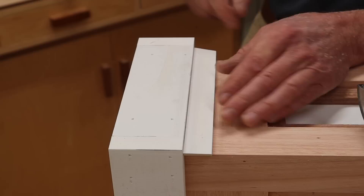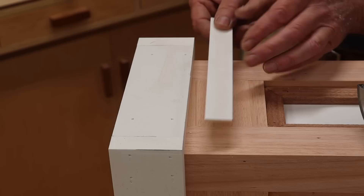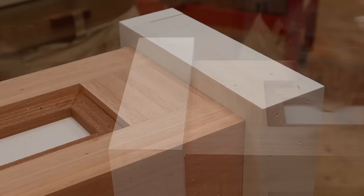The next piece of molding uses the same 7-degree angle, but I did cut this on a piece of Azek that measures a full inch, so it's just a little bit different than the molding in the flat panels. I think the 90-degree angle here looks a little severe, so I'm going to soften this up with a small roundover bit in the router.